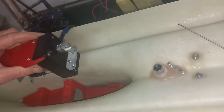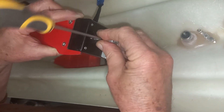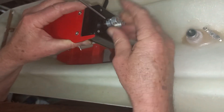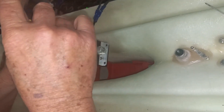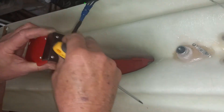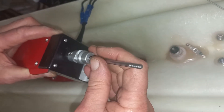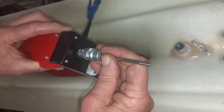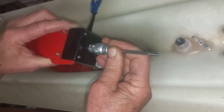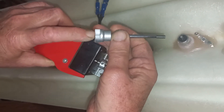Okay, now we're going to move to the boat. Let's start with where you're going to place the coupling. So as you said, you've lost that measurement, so in essence your coupling is loose like that. Slide it on somewhere — give it a gap of six or seven millimetres — and lock one grub screw in place just like that. When you get this buffer to fit, I know it's tight, but it shouldn't shave off one side and not the other side. Work it on slowly until you get it in, take it off again, and work it like that until it's a nice tight fit on both sides without removing too much material on one or other side.